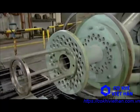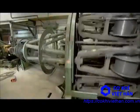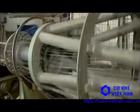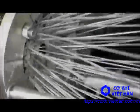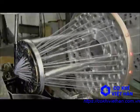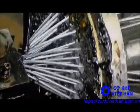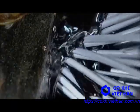a giant winder. There can be as many as 64 wires in a strand, although the typical range is between 19 and 36. The twisting wires converge in a die, which forms them to the required diameter. Lubrication is critical, and not merely to help the wires move smoothly through the die. It also penetrates within to allow slight movement between the wires. This increases their lifespan and prevents the strand from seizing.